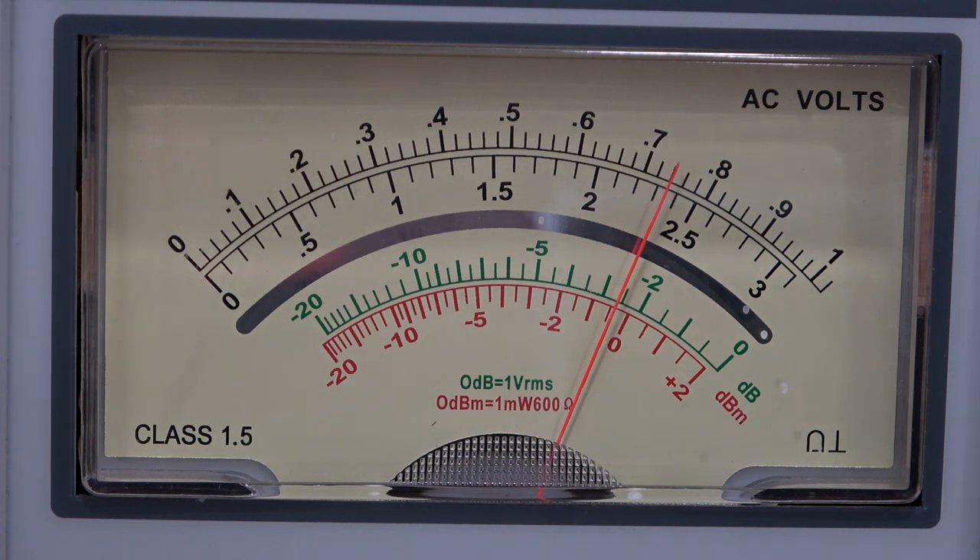At 100 kHz, and now at 120 kHz — it's half a dB down. Not shabby. Shall we go down to 1 dB? I think we'll be in the RF band if we do, but we'll do it. There it is — 1 dB down at 210 kHz. Beat that if you can.